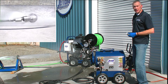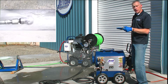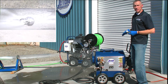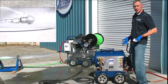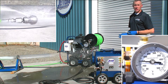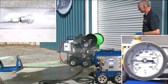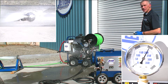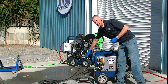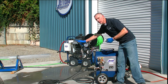With this jetter running about 12 gallons a minute, it's going to get up to about 120 degrees. The lower the flow — say a nine gallon-per-minute jetter — would get up to 140 or 150 depending on the incoming water temperature. A lower-flow nozzle like on a mini hose would get to an even higher temperature yet. And as I stop the flow, the ignition stops; when I start the flow again, the ignition starts.